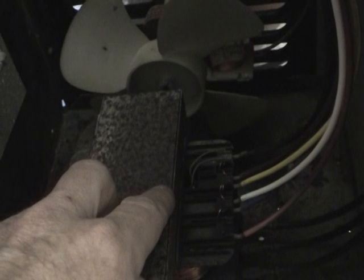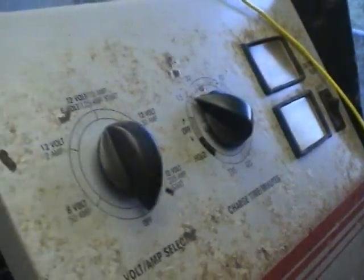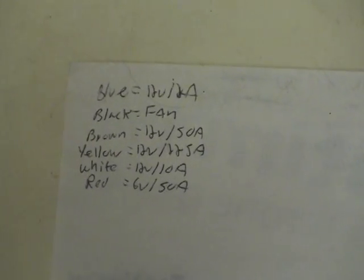It might actually be a thermal fuse - that's probably what it is. A thermistor is a device with a temperature coefficient, so as the transformer heats up this will actually open up and break the circuit. The power supply actually works very well. I basically went through all the mode selections and wrote down what the various taps actually do so I can reference that for the new switch.